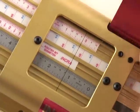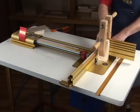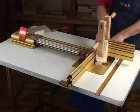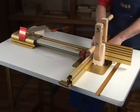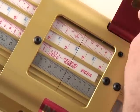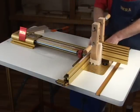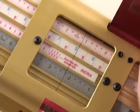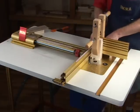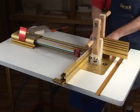After making a scoring pass cut, advance to the first template mark in front of the zero in one or two passes. Once you've reached the first mark, 5A in this example, and made the cut, we'll simply move the fence from one A cut to the next until we've cut across the full width of the material. Keep in mind that your first cut mark will be based on the width of stock that you've centered on. If you've centered on a 2¾-inch wide material as we have, using the Dove J template, with 7B as your center cut, your cut locations will be the same as ours.